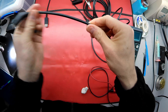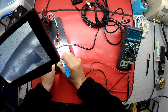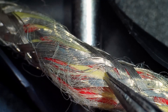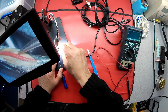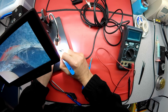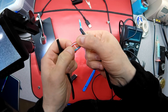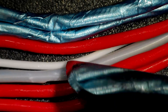Hopefully it's just a broken wire I can resolder within the cable. But where to start? Let's start at the point of the first kink in the cable. Nurse, pass the scalpel please. Inside there's some woven ground shielding, which probably acts as armour too, along with lots of strands of what looks like nylon or polyester — my guess is this helps prevent cable stretch from breaking the wires. There's a mixture of wires, but everything's too tightly packed, so I have no choice but to carefully cut away the shield and strands, exposing three red wires, a couple of twisted and shielded wire bundles, a white wire and a grey sleeve which feels like it contains yet more wires.